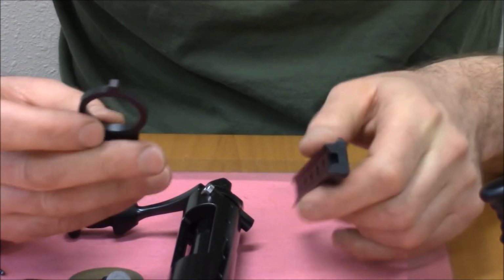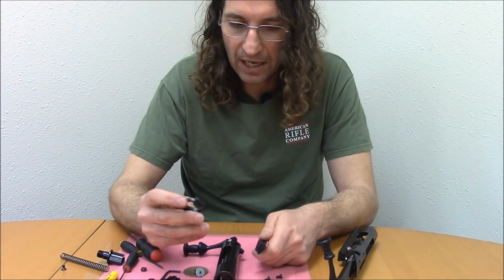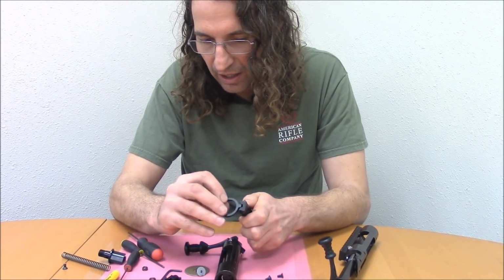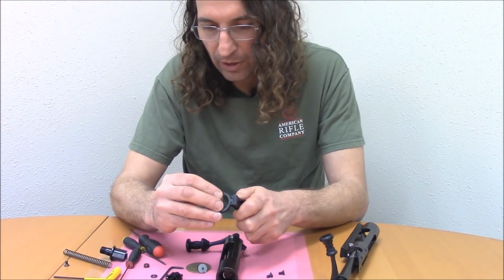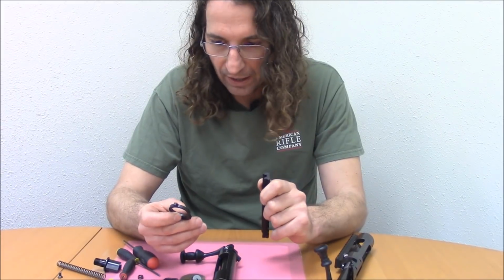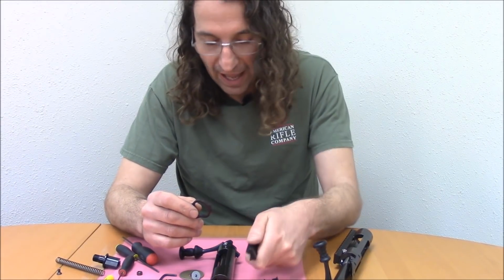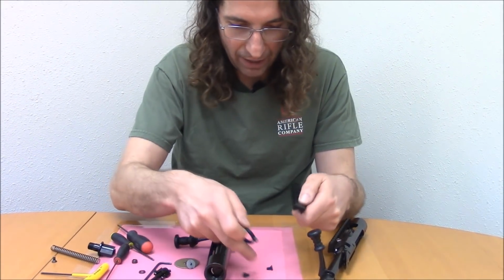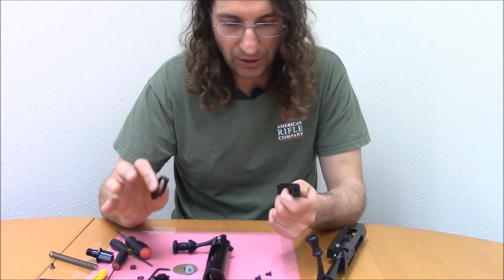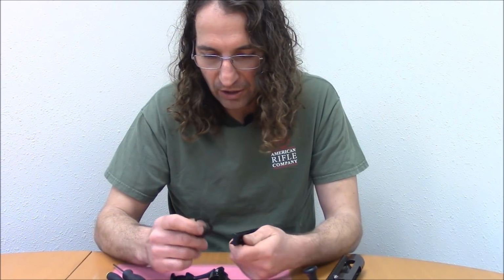The other thing I'm going to do, the nucleuses that all you guys are going to receive, since nobody's received one yet, there's a design modification coming on the bolt stop. I'm actually going to reshape the lug so as to obstruct the rail from forward motion. So the recoil lug is actually going to be a recoil lug for the rail as well. So the rail prevents recoil lug rotation, and the recoil lug prevents any, although there's no way it would have moved with 5 conical head screws, but as an additional safeguard, because I know people are going to ask the question, so let's just put this to bed right now. We will have a bolt stop that also obstructs any forward rotation of the rail.